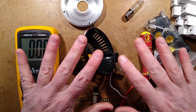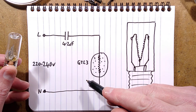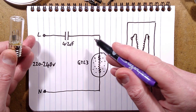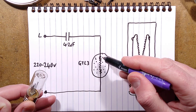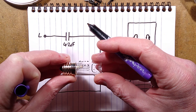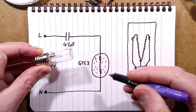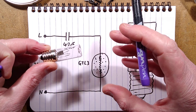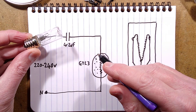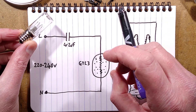I'm going to do a little doodle now and show how these lamps work. Here is a very simple schematic. All the work is done by the lamp — the capacitor allows a certain amount of current to flow in each half cycle. The lamp itself is only rated for about 10 volts. These things were originally used in things like tumble dryers for sterilizing laundry with a transformer output. Normally you'd use a resistor to ballast it, but this uses a capacitor — it's a bit over-minimalist. I'm not sure if it's going to impact the life of the lamp, because the capacitor can actually let through quite high current spikes.